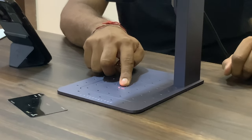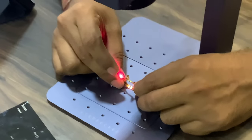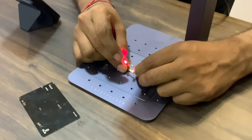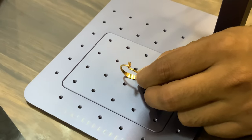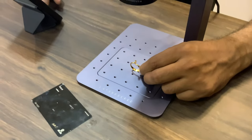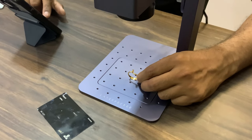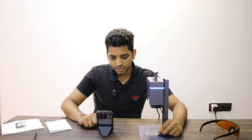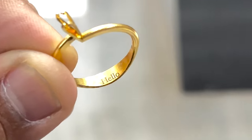I can clearly see a small red box appearing. I will simply place my ring here and tilt it until the red box comes inside the ring. As I can see clearly, the red box is inside the ring — this is good enough. Now I'll press quit preview. Try to keep the ring as steady as possible, press next, settings are already in, and simply press start. Once the file is transferred, press start, confirm, and here it starts printing. This is how it looks after marking.